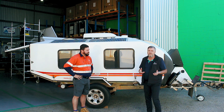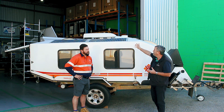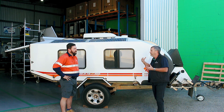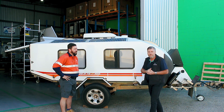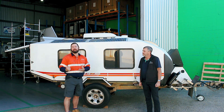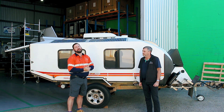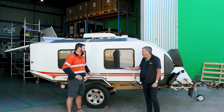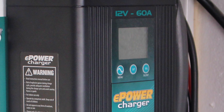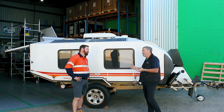We're using a lot of the White Box system where they want to run short-term air conditioning demand, and where they might have limited solar capacity. These types of campers don't have a lot of room for solar, so you're limited on charge. You want that deeper depth of discharge available out of the batteries, which is what the Pro Series allows. With a small generator, lithium allows much faster recharge time. An hour on the generator with a good battery charger gets the energy back into that lithium battery so much faster. This camper has a 60 amp charger on board, which will throw 60 amps per hour into the battery.